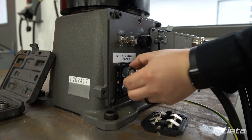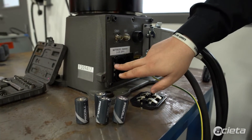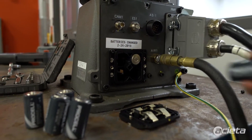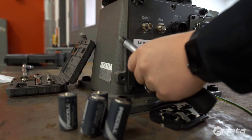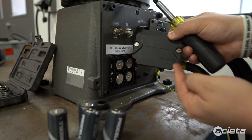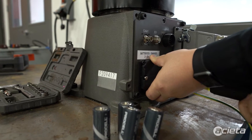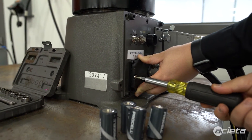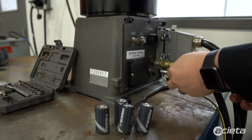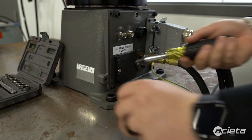Simply pull on this and it will remove every battery out of there. On the inside of the battery box there are stamps indicating the polarity of the batteries that need to be reinserted, so insert them correctly. Two positive and two negative will go in here. Put the cover back on, being sure that the FANUC label points towards the bottom of the base. Tighten it down snug — do not over-tighten, as those screws can snap the heads off.